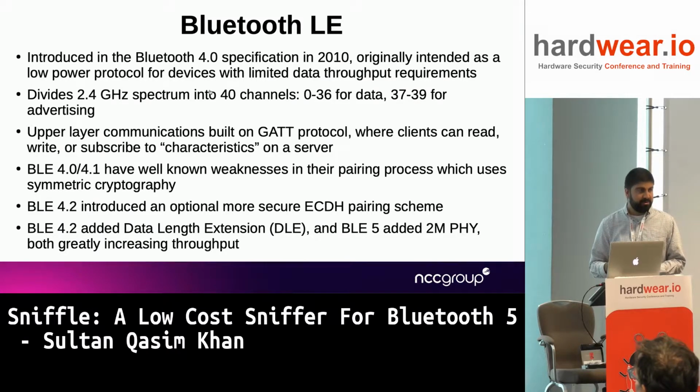Now, at the higher levels of the protocol stack, there is the generic attribute protocol, or GATT. And with GATT, to the user, Bluetooth peripherals will have a number of what are called characteristics that a client can write to, read from, or subscribe to notifications on.